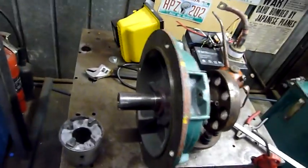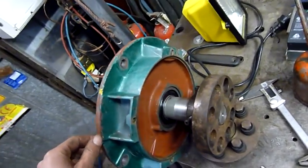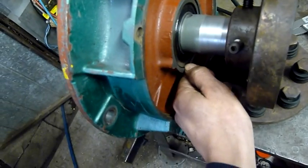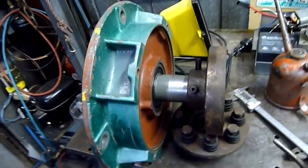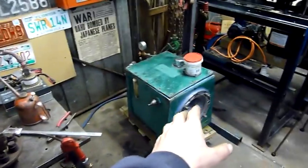Either side of this flange will fit — they're both 35mm bore. Given the degradation and age of the thing, I wasn't expecting it to be metric, but it actually is metric: a 35mm shaft with an 8mm key slot. I just have to make up a retainer — drill and tap these three points here and make a semi-countersunk type retainer, or at least make it with a spigot that can push the bearing hard against the wave washer. That way the shaft and the drive coupling are both at their optimal position. There's a bit of fine fitting involved, but it will work quite well and bolt straight onto there.